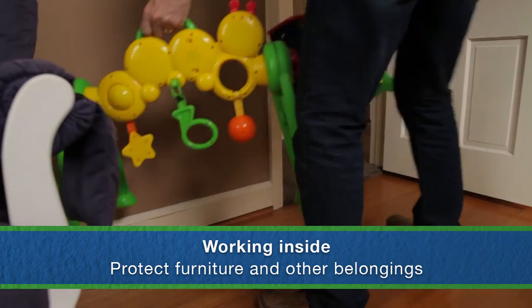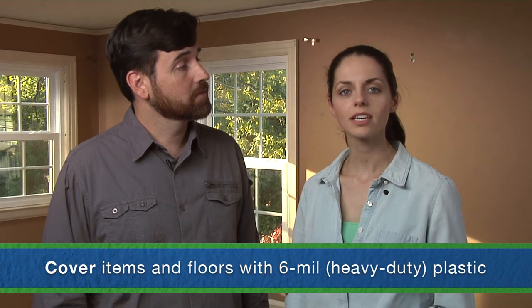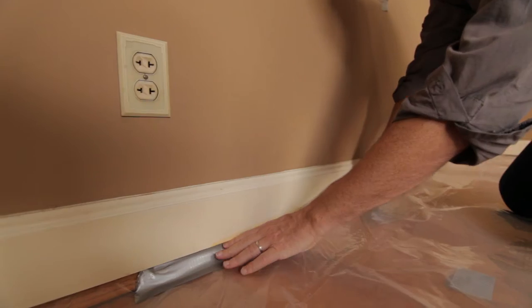Since we'll be painting the windows, we'll take down the curtains. For a larger project such as painting a whole room, you can move everything out of the room or move everything to the center of the room. You need a protected work area large enough for you, your tools, and any surfaces you're working on. For anything that can't be moved, cover it with heavy plastic sheeting — called 6-mil polyethylene plastic sheeting — and seal the sheeting securely with duct tape. Cover the floors at least 6 feet in all directions from where you'll be working. Put all your tools and supplies on the plastic sheeting so you don't have to walk away from the work area with dust on your shoes.